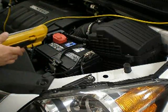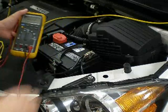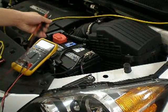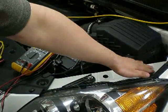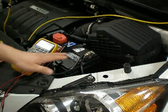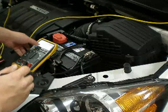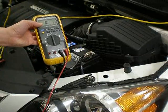That's why you want to use a proper multimeter — it will give you the proper type of isolation when you're testing wires. One thing I want to show you today is very basic: how to find ground. You might think the whole chassis on a vehicle is ground, and for the most part yes, but you've got to realize that in any vehicle these days there are a lot of body parts that are spot welded — they tack weld a couple of welds on a piece of metal to the rest of the body. And because of that it doesn't give you a very good ground, and by just looking at a vehicle you can't tell. That's why you want to have a multimeter.